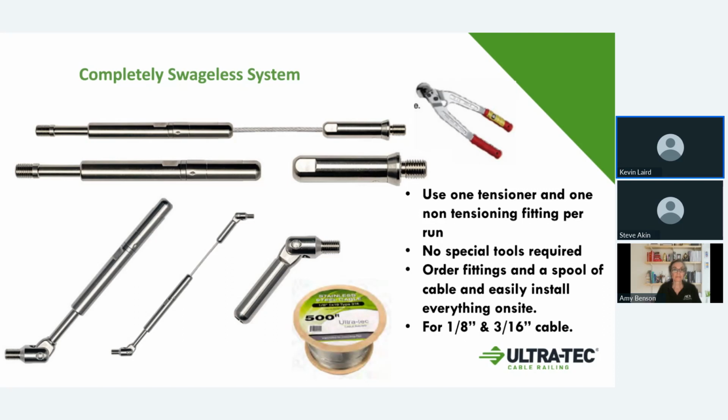You insert the cable into the fitting, and as you go to pull it out, the harder and more pressure on the pull, the tighter the internals grab the cable. We also have a fitting that goes with the Invisaware that is called a pull lock, and that one, you actually push the cable completely through the fitting and out the backside, and you pull tension on that a little bit, and it grabs the cable, and then you can just cut the excess of the cable off. It doesn't require measuring and cutting of the cable for the push lock fitting system.